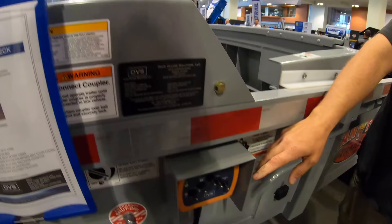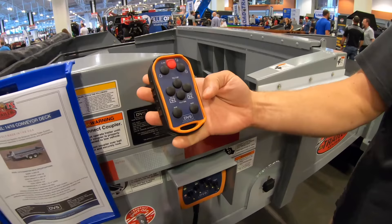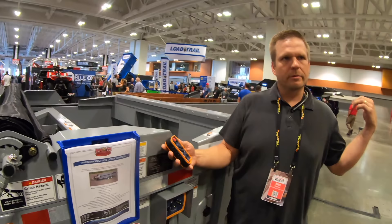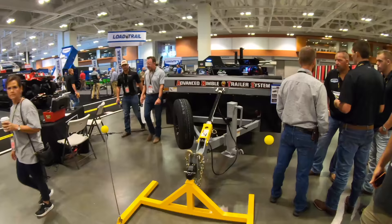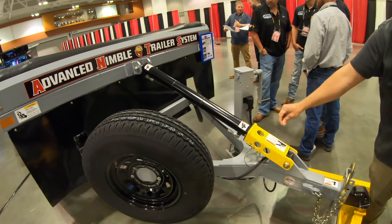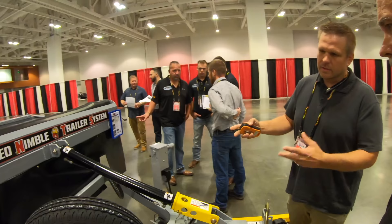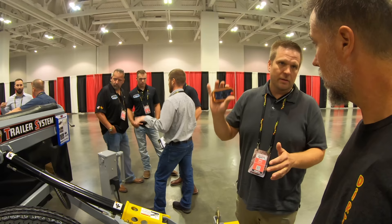We've got a full trailer control system right here. You can control the bed in and out, the tilt function up and down. Also, we do a handheld remote. So while you're in the cab of your skid steer and you have a load of gravel, you can pull up your remote, start the machine, dump material right in, and go run it — very clean, very little debris on the ground. We have the ability to pull this safety stop out of the way and compress the cylinder, which raises the rear of the trailer up. The advantage of that is if you're in a tight site where you're wanting to make tall piles, not long piles, you can just keep pushing the material uphill and keep stacking.